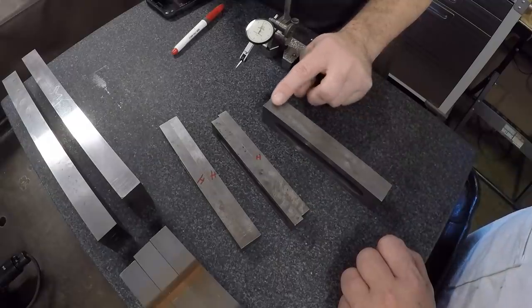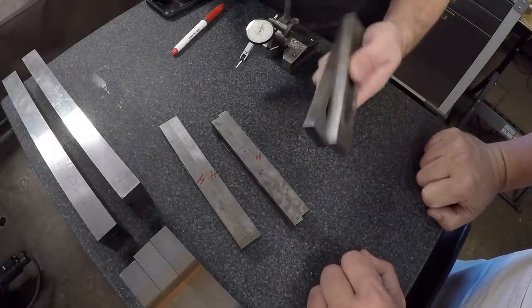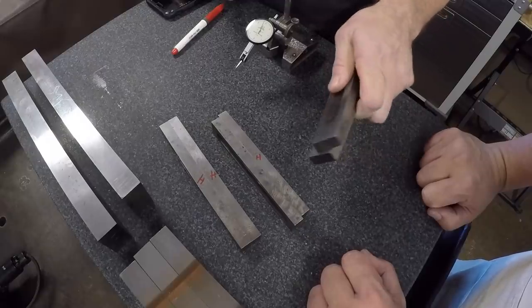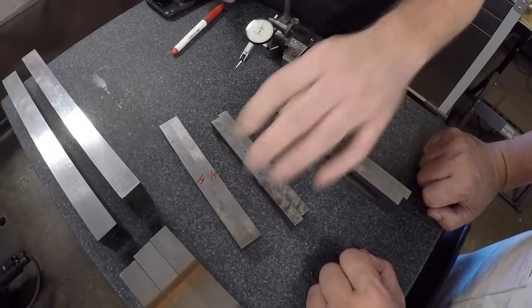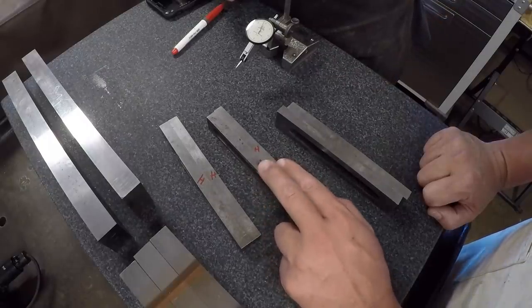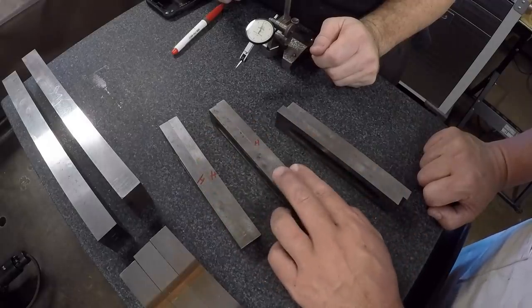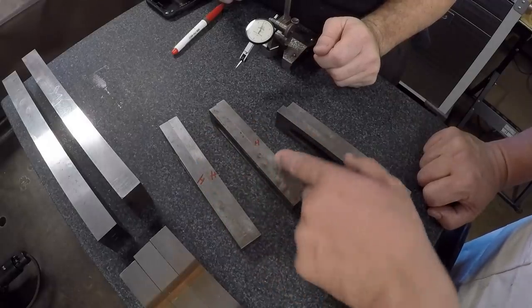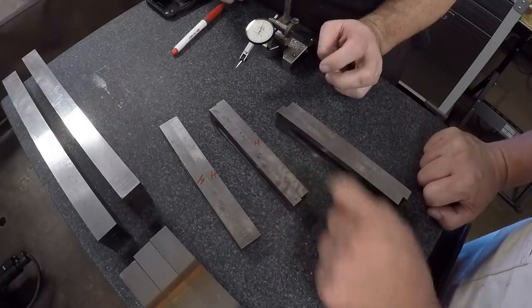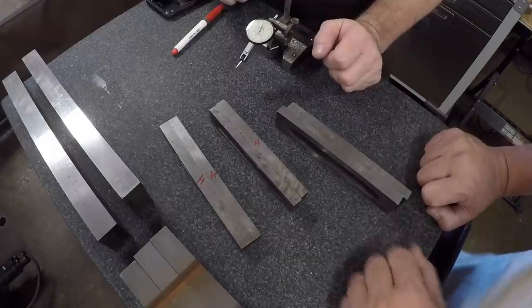Yeah, my comment was take the precision ground flat stones and continue to polish these. They're fantastic. I can only make them worse today, maybe. These I think we can improve on my grinder. Yeah, and then hopefully we'll have a little more luck getting a good measurement on these once you touch them off. Right. And we're not taking a lot of material off this. This is going to be just tenths. Yep. So let's go hit these and see what we do with these. Awesome.